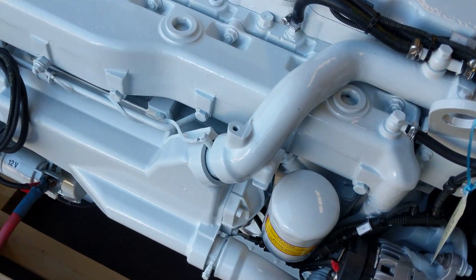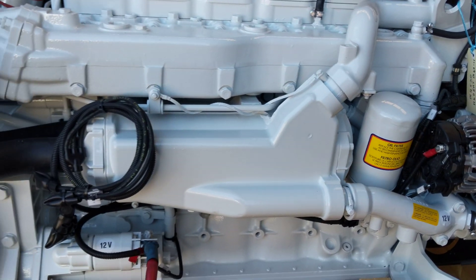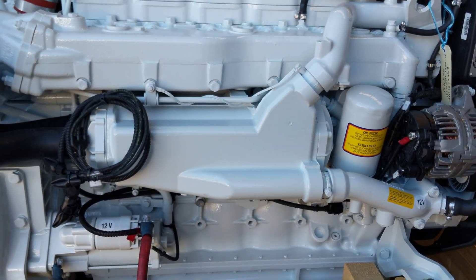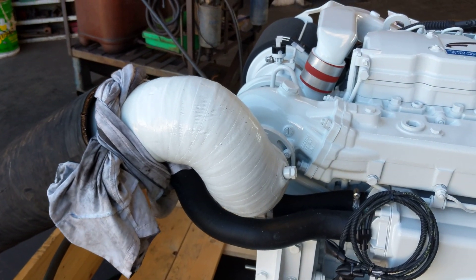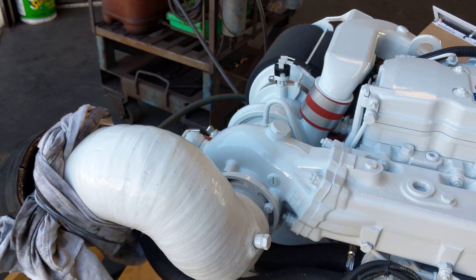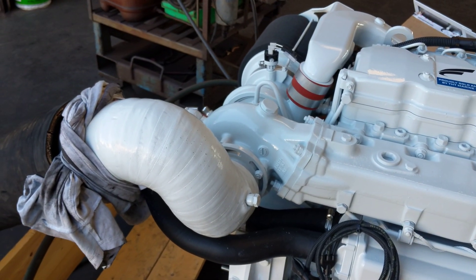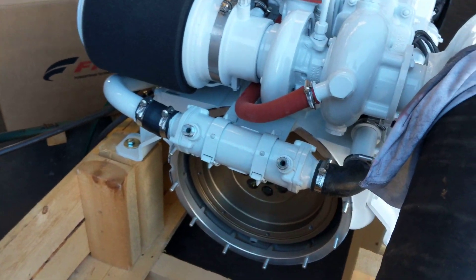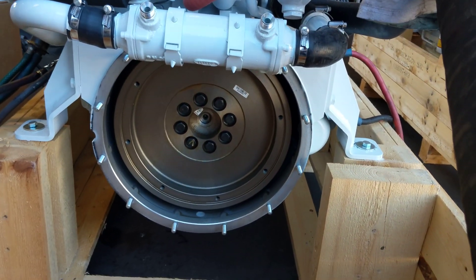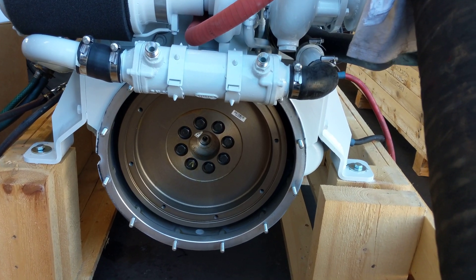As I come along, you'll see we've got an oil filter — simple spin-on — tucked in right there. And this here is the main freshwater-seawater heat exchanger. Every engine from THT as standard comes with a wet exhaust riser right there, which sends both the exhaust gas and all of the raw water straight out the back. Gearbox oil coolers are included as standard, and these here are an SAE 3 with an 11 inch flywheel.